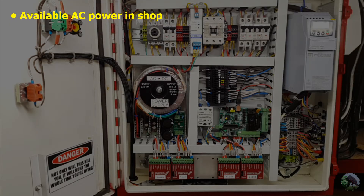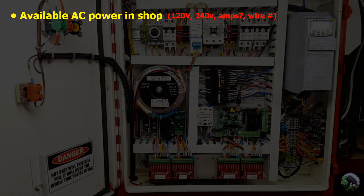The first thing you need to take into account is what is the available AC power in your shop where the CNC is going to run. For most of us here in North America, it's going to be either 120 volt or 240 volt AC, and it's going to vary in the number of amps available — from as low as 15 amps up to 50 amp 240 volt. So it's a big delta as far as what's available, and it's going to affect your design and what's possible.